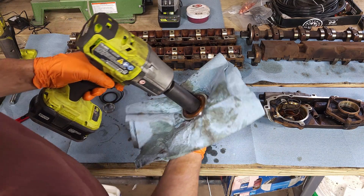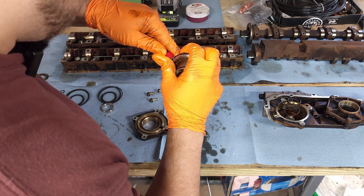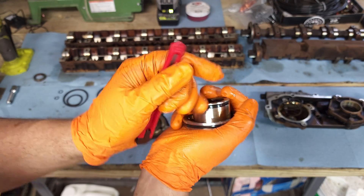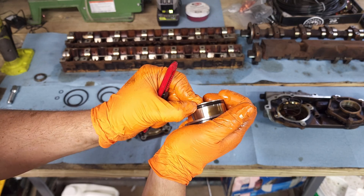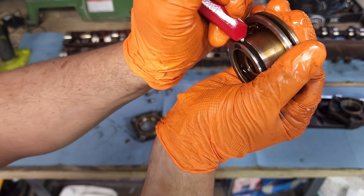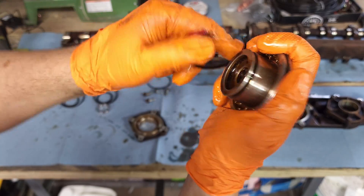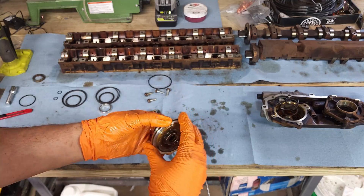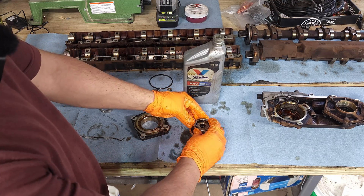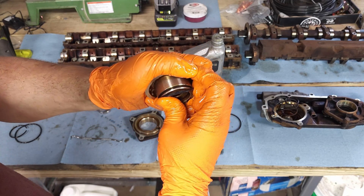I couldn't find a torque spec on putting these back in so I'm just going to ugga-dug a couple. Now I'm going to extract the rings - you have to cut these outer ones off. I've set my adjustable little razor just so the tip comes out; I don't want to gouge any of this stuff and ruin a seal. I'm going to cut straight into it - it's basically just the right width to pop this loose. Just be careful, take your time. The other ones are just O-rings - use the O-ring tool for that. Then get the small O-ring on, then the large one. The pain is getting these plastic rings to go on over top of the other stuff - just keep working it around until it gets in.